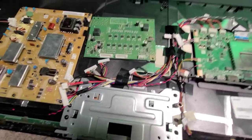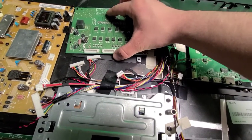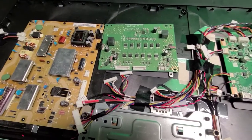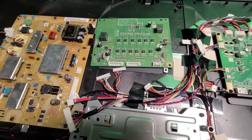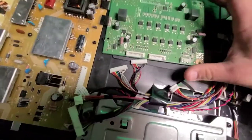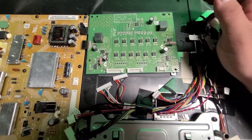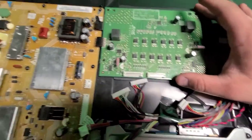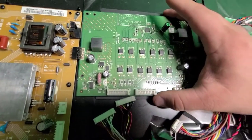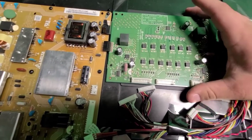I had been using it for about two weeks and all of a sudden the screen went black. I shined a light on the front of the screen and could see the picture, which tells me the backlight was out. I did some research on forums and a lot of people were saying to replace all three boards — this is the backlight engine — and they said these 16-pin connectors plug into another board, which is very uncommon.